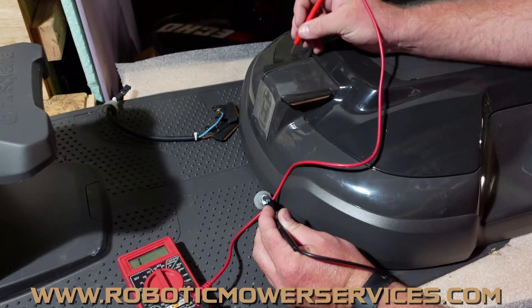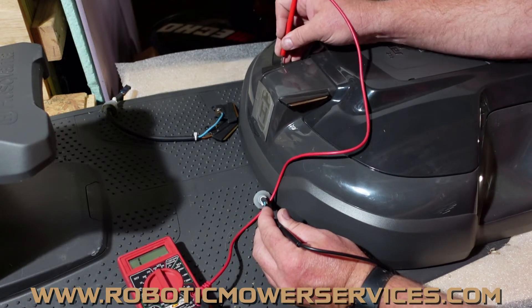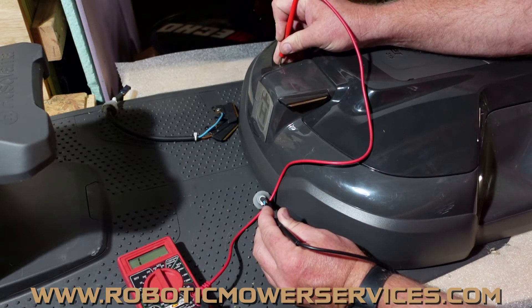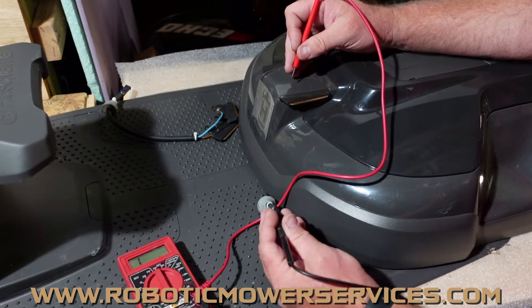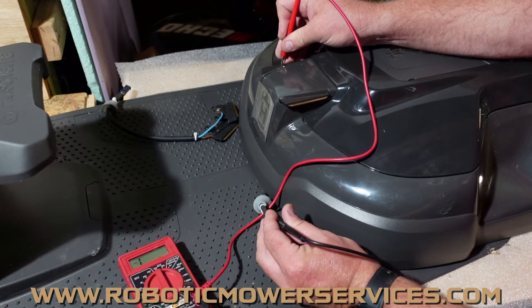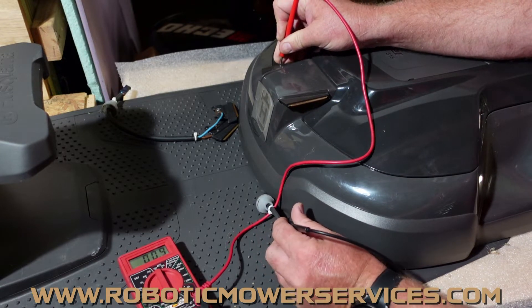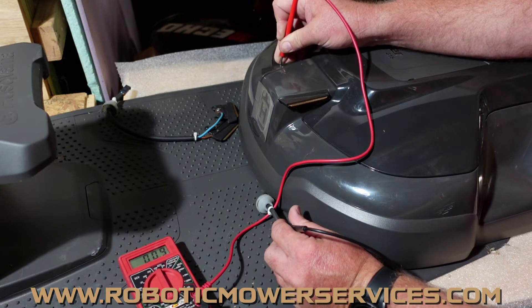Now, as I was saying, if you don't know which one's which, there's no voltage coming through here — you're just checking for resistance. If you would go to the wrong one, you would get no continuity. Now if we switch over to the blue one and go to the opposite side and test it — there we go — just under one ohm of resistance, so that side is good too.